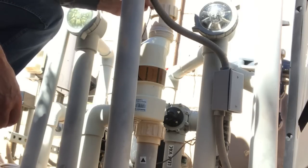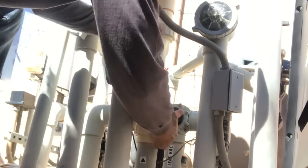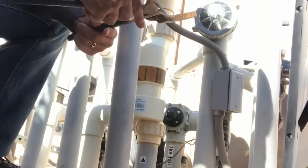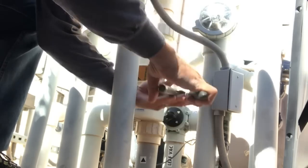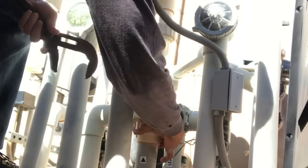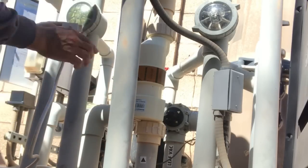I'm just going to slowly snug them up — I don't want to crank them down yet. Now they're hand tight. Then I'll grab my channel locks, make sure they're open enough, and gently and carefully — so I don't grab any wire — just snug this down a little bit. Did you see that? Not even a quarter turn. Just a little bit, because these are huge channel locks and they'll give you a lot of torque, so you don't want to go crazy. Just gently snug that down. Also remember — I have not yet plugged in the power cord, because I don't want to do that until the very last thing.